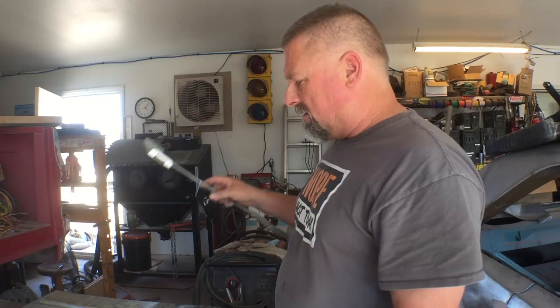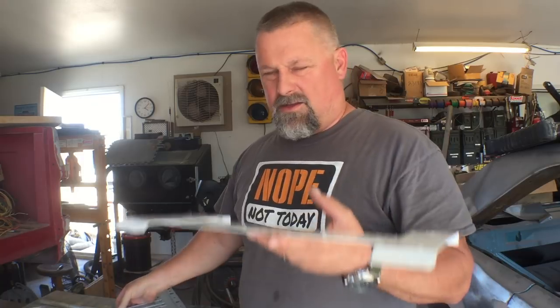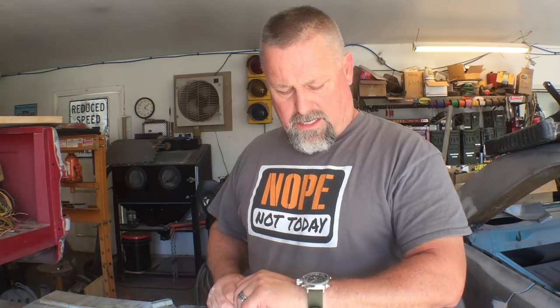That's no good. So I made a replacement mount out of 16-gauge steel, which is considerably stiffer. The original I just screwed in with a small screw, but this one is actually going to get bolted in with four quarter-20 bolts. It's just after 5 o'clock PM. In a couple of hours the sun will have gone down, there's a nice little breeze tonight, so I'll turn the AC on to get the temperature down. If it works, I'll install this tonight; if not, I'll install it first thing in the morning. I want to get this AC up and running this week.